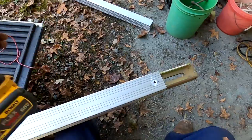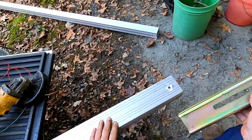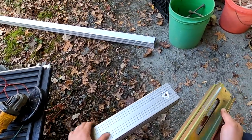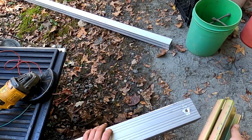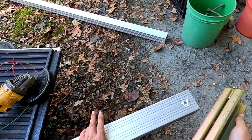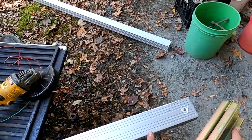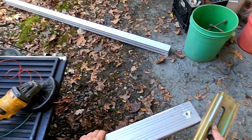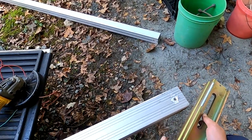Fireworks show. So for future reference, what you need to remember is that aluminum generally does not spark, but steel usually will when you're using a grinder. And sometimes you'll come across stainless steel, which is non-magnetic. The really good stainless steel is non-magnetic. So sometimes to determine whether it's stainless steel or aluminum, take your grinder and hit it. Steel will always spark. So keep that in mind.